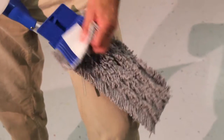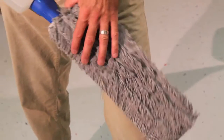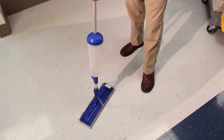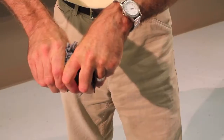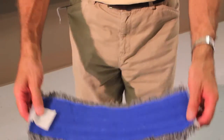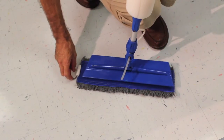The floor finish tool uses a special frame to ensure a strong Velcro grip to the mop. It is recommended to use a one-gallon container to transport and fill the tank with finish. This style of applicator uses the thumb release at the top of the handle. Precharge the finish mop head in a plastic bag with a little floor finish, ensuring thorough saturation. Walk to the back of the room, placing the mop out on the floor and attach the frame to the Velcro backing.